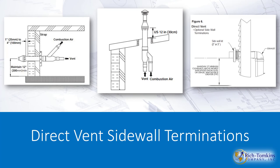The boiler uses a transducer-type pressure switch. If you're exhausting through the sidewall and intaking from the roof — or vice versa — you have two different planes with different pressure differentials. The transducer pressure switch detects this and adjusts the controls to ensure the unit operates optimally.